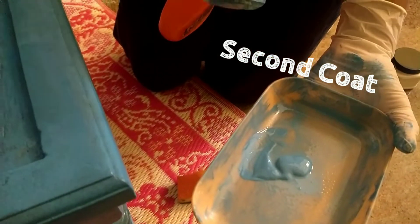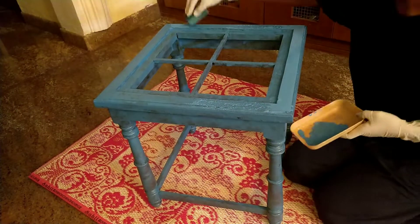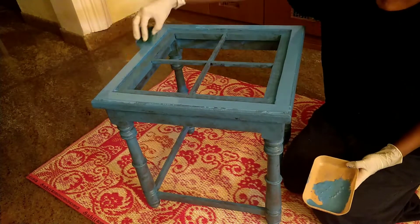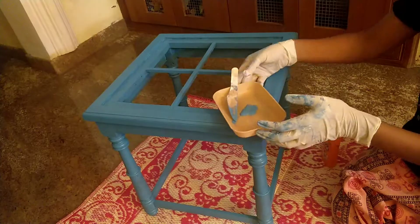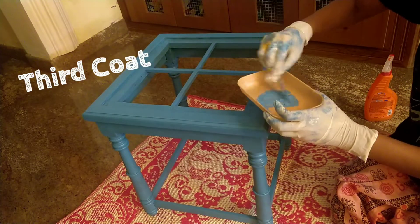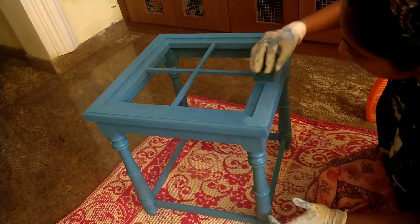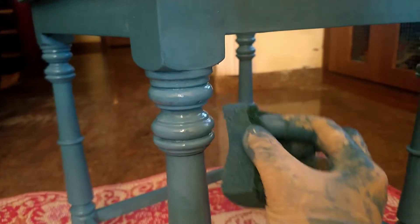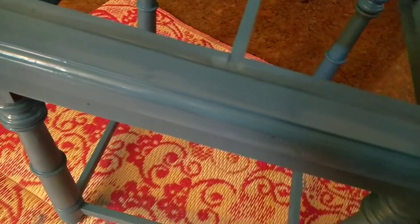In my second coat I'm going to add one spritz of water just to thin it down a bit, and then we're going to repeat the process and apply a thin layer over our first coat. You want to make sure you've given the first coat enough time to dry — at least two to three hours. Chalk paint dries almost instantly but I would really suggest taking a day between each of the coats. That brings us to our third coat, which is slightly thinner than my second coat. I'm going to spread a thin layer over the entire table, making sure it's completely covered with no wood coming through, and retouching any points that require extra paint. This is how my table looks after three coats — completely covered and I'm happy with the coverage.